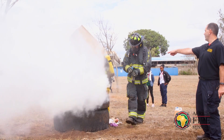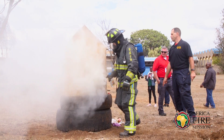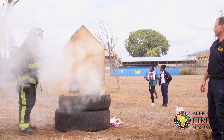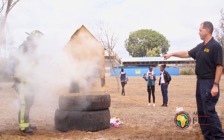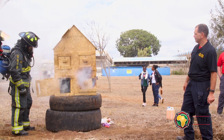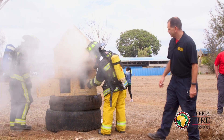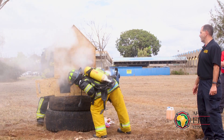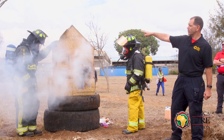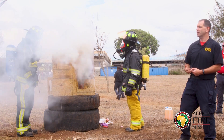Now go ahead and open that and open the door on the other side and we can watch the flash. Open both middle doors and open two. Notice the change in color of the smoke — as it changes a little white it's going down a little bit. So if we come along and you open a window and you open the door and someone's going in there and it's not coordinated, we can get all the fire to move across. Notice how it's pushing out everywhere. That fast smoke pushing out through all your cracks tells you you have a hot fire somewhere in the building.